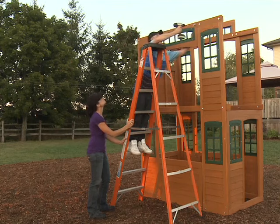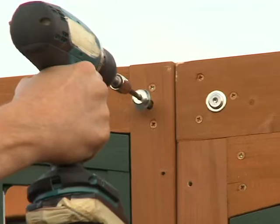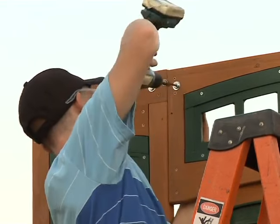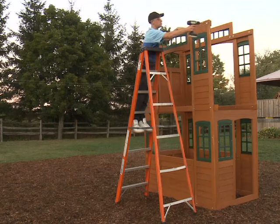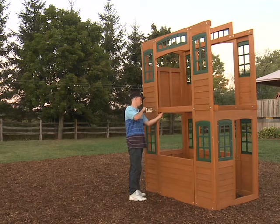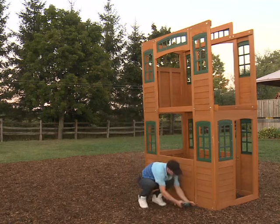Loosely attached to the long wall tie with two WB9 wafer bolts with 5/16 inch flat washer using the previously installed T-nuts. Make sure the narrow window panels are square and tight to the half panel and transom panel back, then tighten all 16 wafer bolts on the back side.